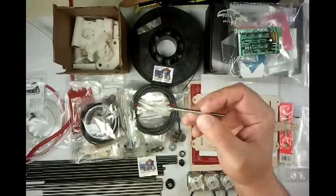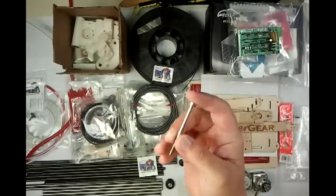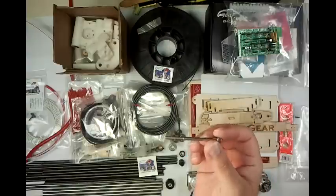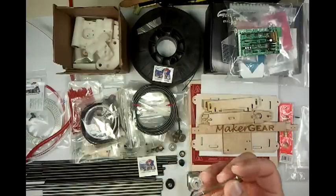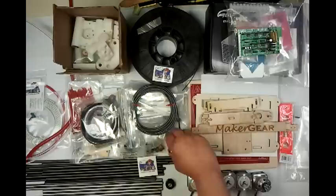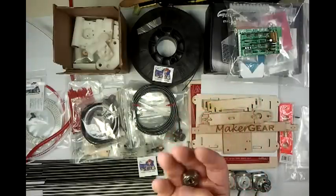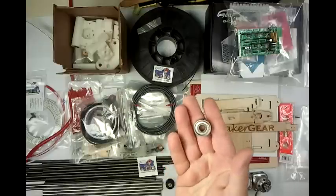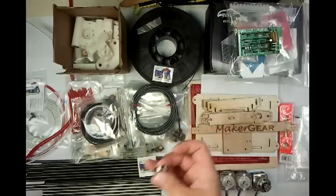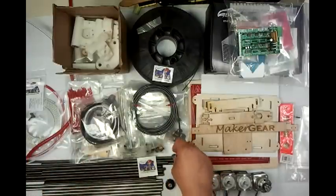All the hardware inside the machine is stainless steel also, not just the threaded rods. RepRap typically uses black oxide or raw hardware because they're cheap. These are never going to oxidize. You will occasionally see people build RepRaps using unshielded or plastic-shielded bushings, but all his bushings are metal shielded, so they're probably never going to give up their lubrication.